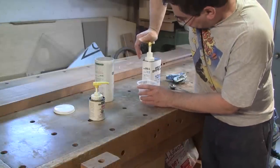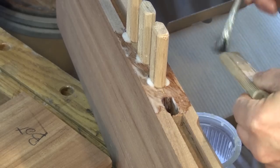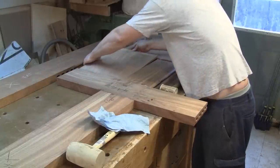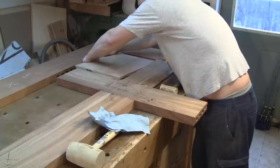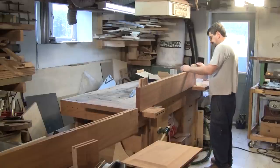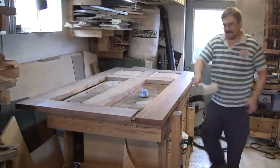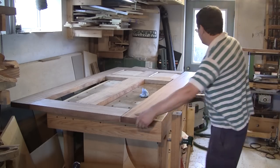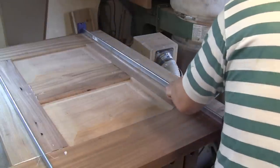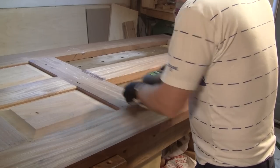I prepare a batch of slow cure epoxy for the glue-up. I start with the bottom of the door. I spread glue inside the mortises and on the dominoes, then install the panels and glue the stiles. With forty dominoes per door, sometimes some joints need a little persuasion. The last thing to do is to put three clamps, one in front of each rail. When the glue is dry, I sand the excess flush.